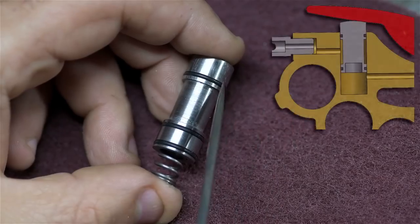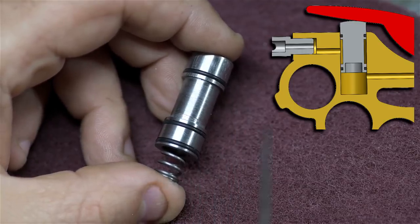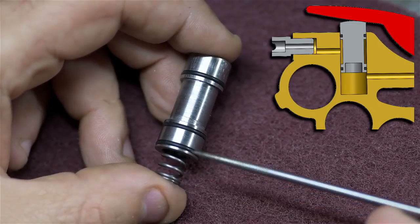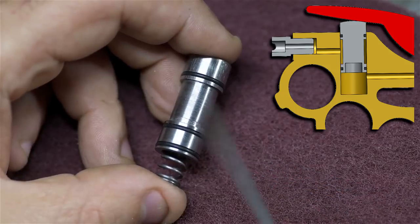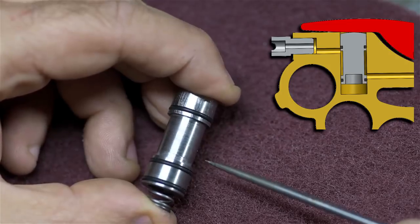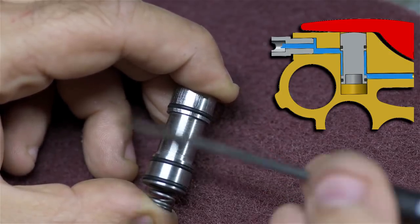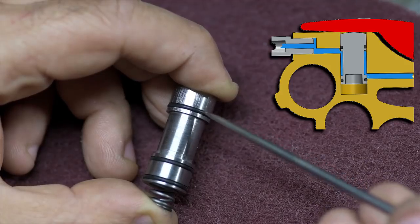The original design only had two O-rings. I've since added a third, and I'll try to explain why. Previously, when I had just the two O-rings, air was coming in, let's say from the right, at about this level, below the shuttle valve, below the piston here. It would try to come up the valve, but be stopped by this O-ring. So then when you push the lever, the O-ring would come below the air inlet. Air could flow around this reduced section and out the nozzle without leaking through the top of the blowgun. That's what this top O-ring is for.